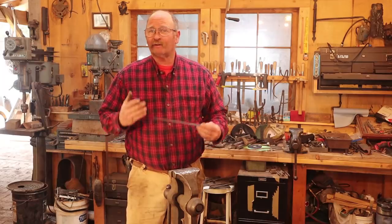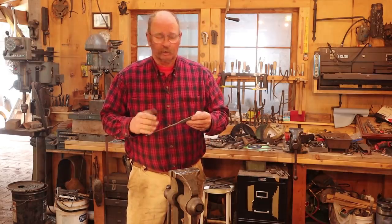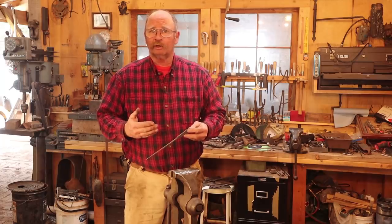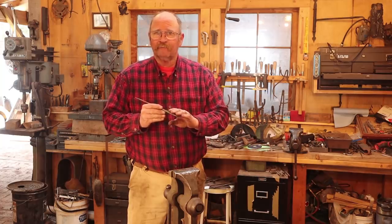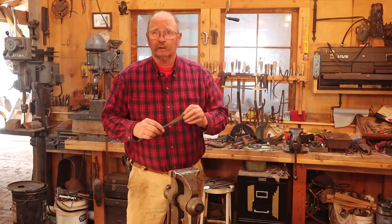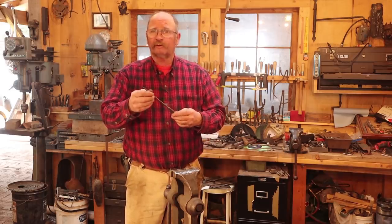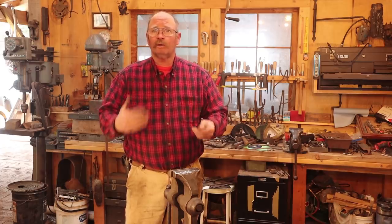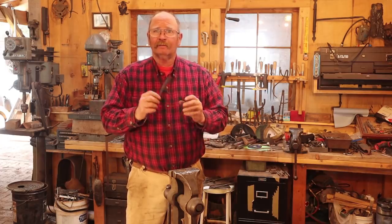After the epic amount of filing we did in the wing divider video, I thought I wouldn't get quite so carried away on this project, so I'm just going to cover the basics. The amount of filing, grinding, or finishing that you want to do is entirely up to you. In the end, the only thing that really matters is that the back is good and flat so that it can be polished as part of the sharpening, and that the bevel is good and flat. We're just going to file this to shape real quick, flatten the back, then harden and temper it.